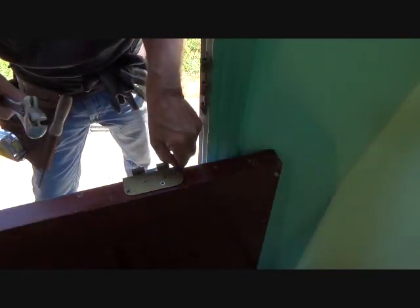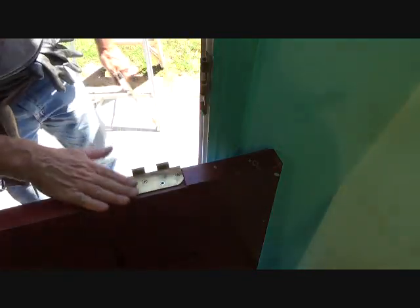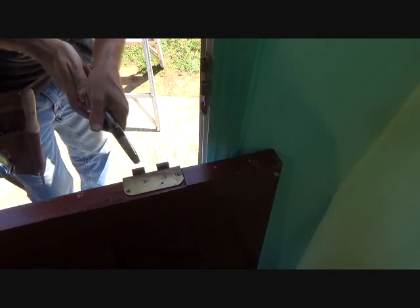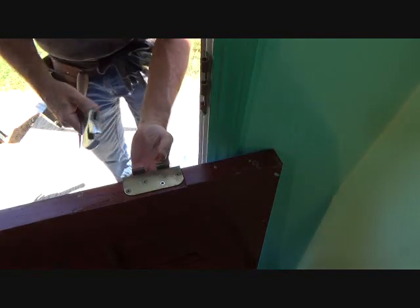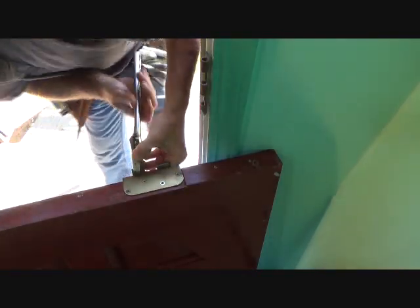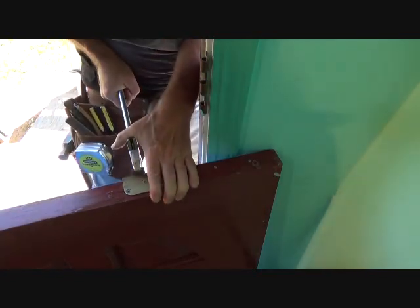I've got a big crescent wrench here. Make sure you remember what side is the front of the door and what side is the back — this was on the inside, that was on the outside. I want to pull those nibs towards the inside, so I'm going to push them down. Instead of holding the crescent wrench normally, I'm going to put it upside down to get a better bite without hitting the back edge of the door. I'll get it as tight as I can and bend down on it a little bit.